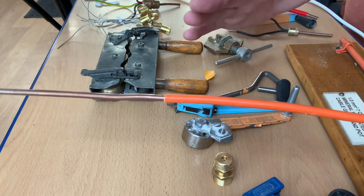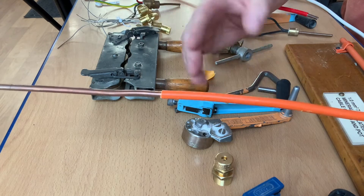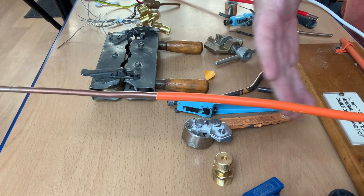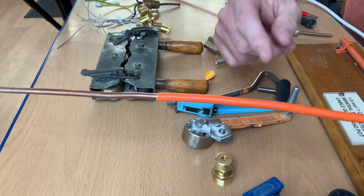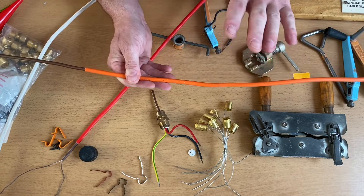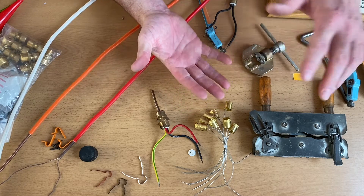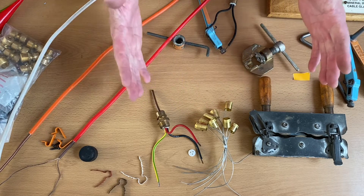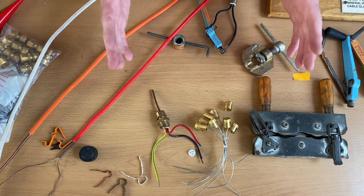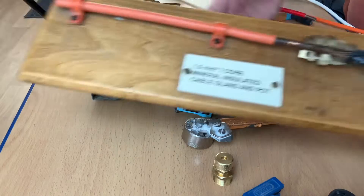Orange - hopefully you remember that the standard colour for an electrical circuit is orange. If you saw a blue pipe it would be full of water, a yellow pipe full of gas. If you saw an orange ducting - and you sometimes see this by the side of the road when roundabouts are being refurbished - it's electrical. So: white is emergency lighting, red is for fire alarm, orange is the general colour for electrical systems, and you can also have mineral insulated cable bare.